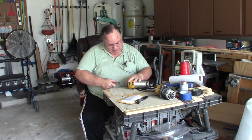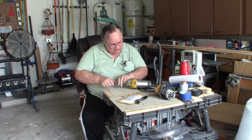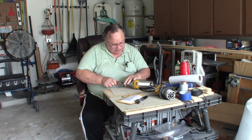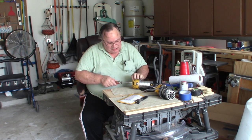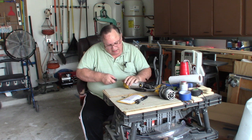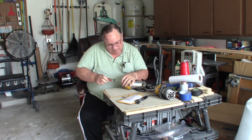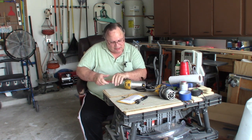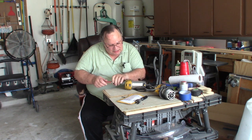I think I've recorded me doing this once before, but it's been a while back, when I replaced the brushes in this router, and that was the first time I had replaced the brushes. And I wasn't quite sure what I was going to be getting into in the process. Turned out to be a no-brainer, basically. Just, like I said, pull this cap off and pull the brushes out and put the new brushes in and put the cap back on, and you're done. So it's nothing to be worried about if you have the same problem. Don't be afraid to go ahead and jump in there and take care of it.